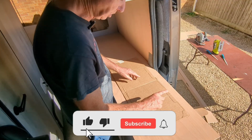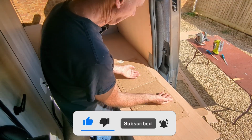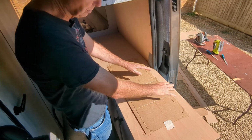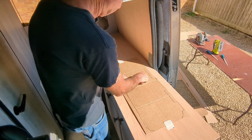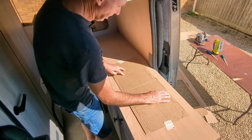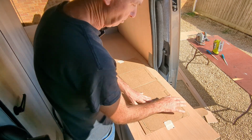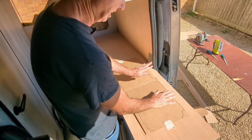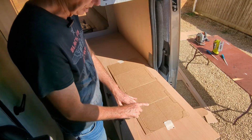Because you have to cut to different depths, so it sits down in, and it's like a shelf support underneath. I'll show you when I'm cutting it, but it'll make more sense then. So you cut out one bit, and then the bits that are outside the dotted lines here, you cut down basically halfway down through the worktop to let it sit into. A bit complicated, but the template makes it so much easier. It's definitely worth getting one.